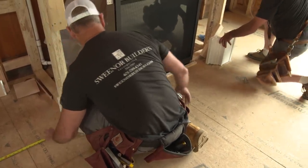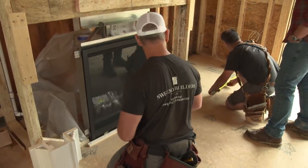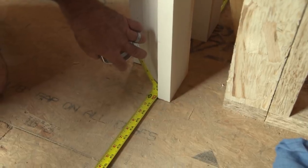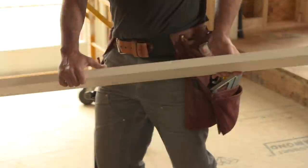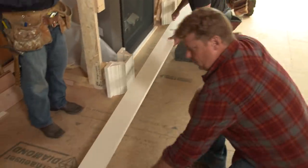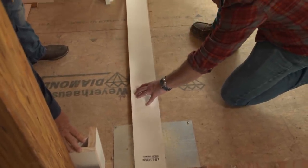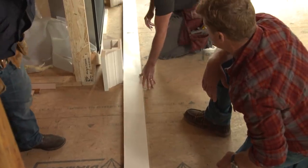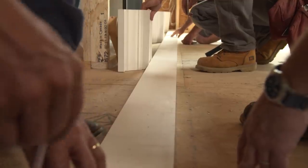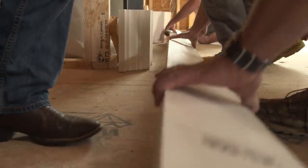Hold this at 48 and a sixteenth here. Garrett, if you put yours to 48 and a sixteenth, Jeff, that's what you should be left over with. Exactly — 48 and a sixteenth. Now that our pieces are all set exactly where they're going to go, we have to transfer all those measurements to the other side of the room. But we don't want to measure — we're actually going to use a layout stick to transfer the measurements. A story pole for a coffered ceiling, Tommy? A story pole is always smart because if you have a measurement off, even an eighth or a quarter of an inch, it's not going to be right.